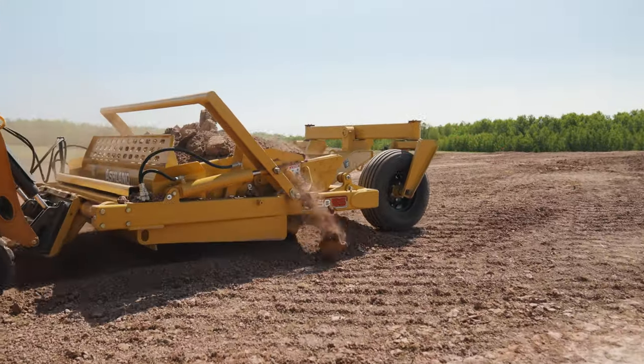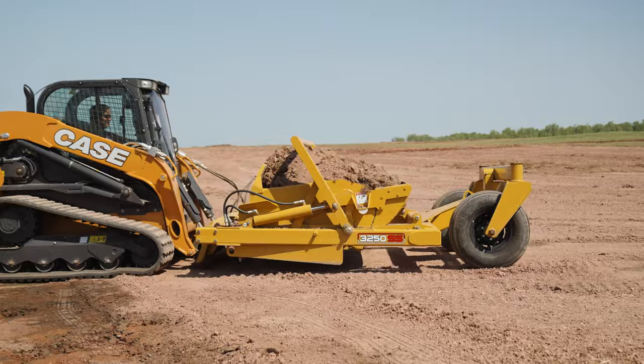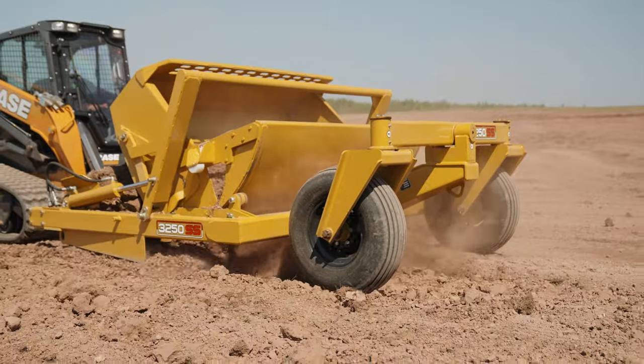As we raise it up, the door comes closed. When we go to the area where you want to unload the material, we simply hydraulically put this thing into the over-center dump position, which allows it to rotate open and allow the material to dump forward out the front.